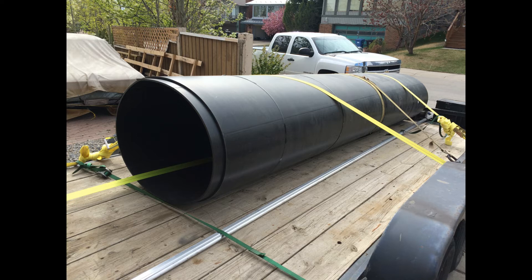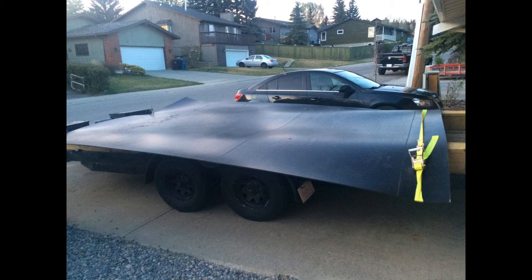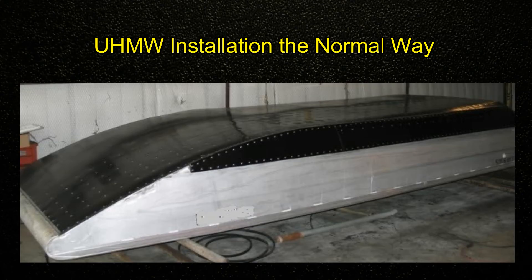As I showed in a previous video, I bought this poly as a single large piece as a roll, and after unrolling it I did have to let it sit for a while to get the memory out. I've never installed this poly before, but from forums and the internet the typical way is that the boat is flipped upside down, the poly is laid out over top — preferably during a hot summer day which makes the material more pliable — and then it's either riveted or screwed to the hull. The bottom and the sides are typically done as separate pieces.